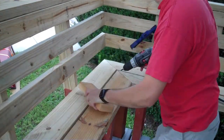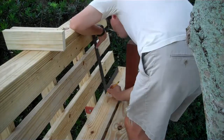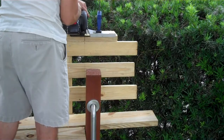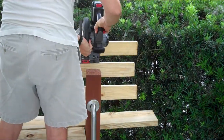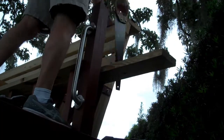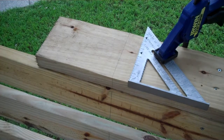I cut a few side pieces to go from my 4x4 uprights to the backrests, and they needed a 12.5 degree angle on the backrest side. My boards extended out past the end of my platform to the full length of the lumber, so after I marked where my armrests would fall on them, I carried that line up and cut off all the excess using my circular saw. I've had to finish off the cuts near the end with a handsaw. Incidentally, the guard on the circular saw is 1.5 inches away from the blade, so instead of getting your tape measure out, you can just use a 2x4 to set the correct distance.